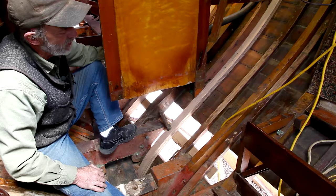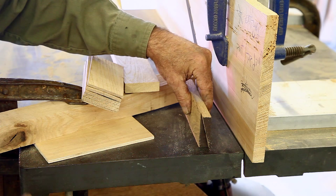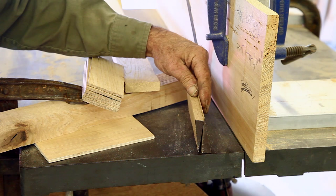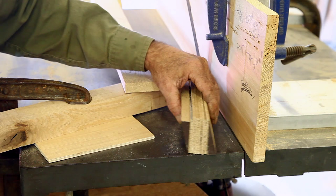I'm here at my ship saw and I'm just about to push this piece of wood through. What's going to happen is we're going to progressively bevel it and it's going to come out the other side looking like this. What I'm going to do at that point is invert the two pieces like that. Now you have a rhombus, but it's not thick enough, so we're going to place the laminate pile — which are all parallel laminates — in between like that.